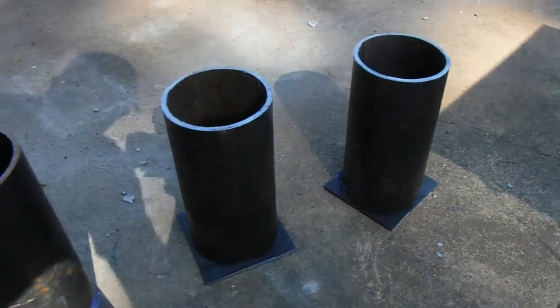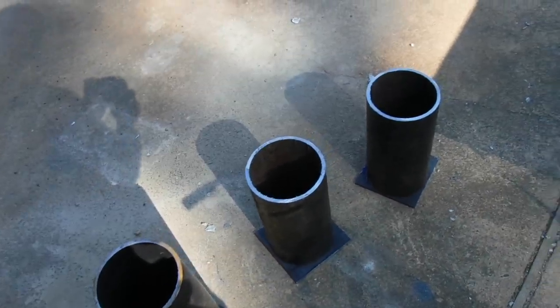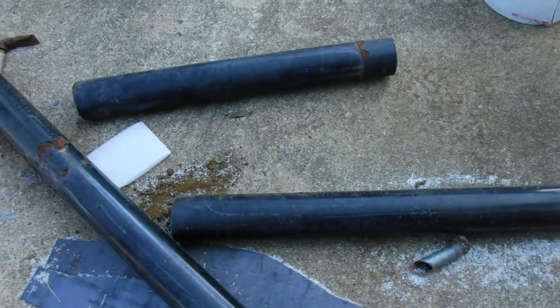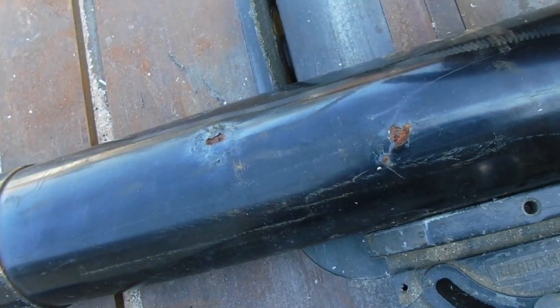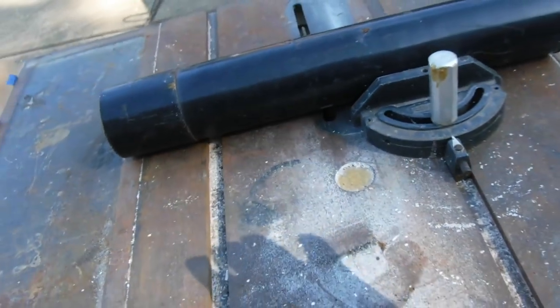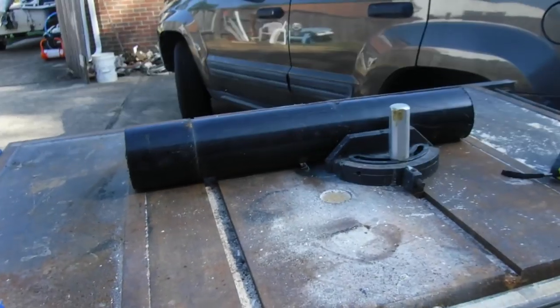Let me get this other pipe cut out and we'll do a little testing. We went ahead and finished cutting — we've got three large crucibles ready to weld. I won't have any problem melting probably 15 pounds of aluminum in that big one. Now let's get started on the pipe over here and make three out of this. I put my metal cutting blade in on the table saw — already cut one and it came out really straight. Let's do another one right now.